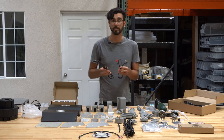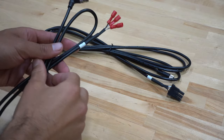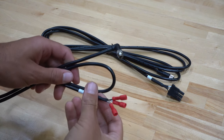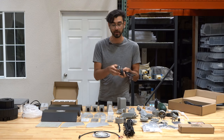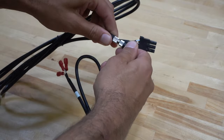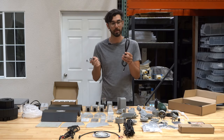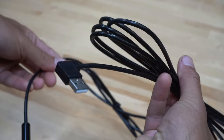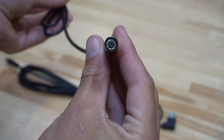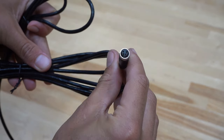New in the version 1.6 kit is a three-wire vacuum pump cable. The addition of the third wire is for protected earth grounding. The three quick-connect connectors attach to the terminals on the vacuum pump, and this two-part cable has a 90 degree waterproof connection — one portion for the y-axis and one for the z-axis. Here is the camera and the camera cable. On one side is the USB connection for plugging into the Raspberry Pi, in the middle is a 90 degree waterproof connection, and on the other side is the camera module which gets held by the camera mount halves on the end of the z-axis.